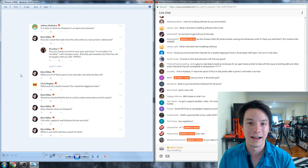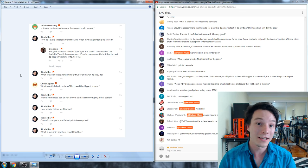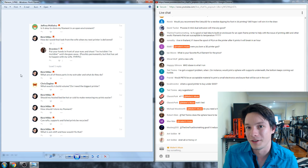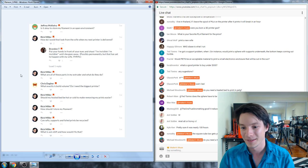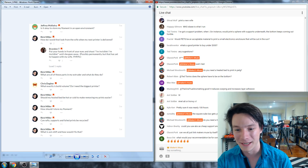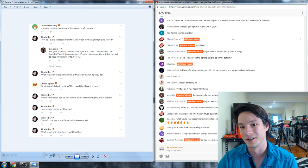For a beginner I'd recommend a print volume of around 150mm — it sounds small, but you're still looking at six to eight hours of print time easily. If you want bigger, slice it up using a program like MeshMixer and join it together with two-part epoxy, then sand it — no one will know the difference. You also avoid the risk of the whole print failing halfway through. Don't fall for the big build volume trap — larger beds are also harder to dial in.